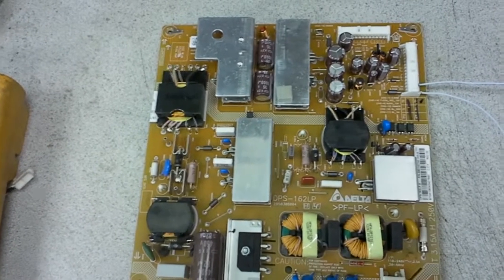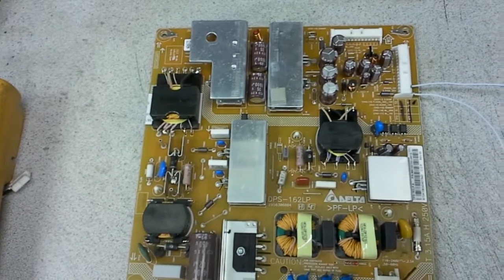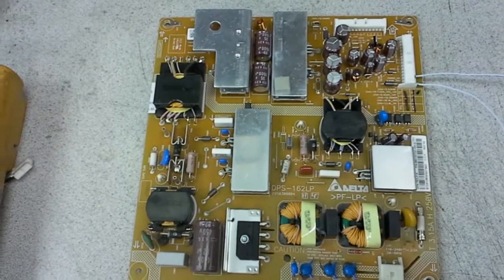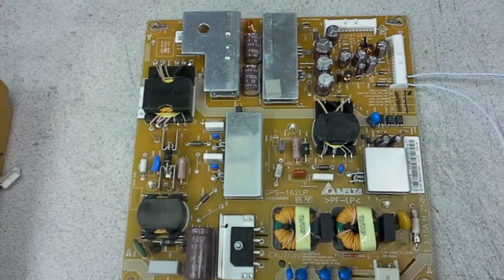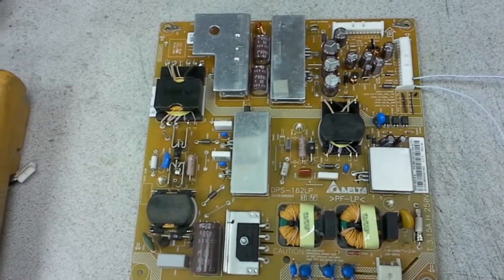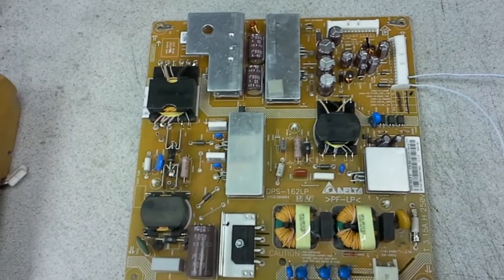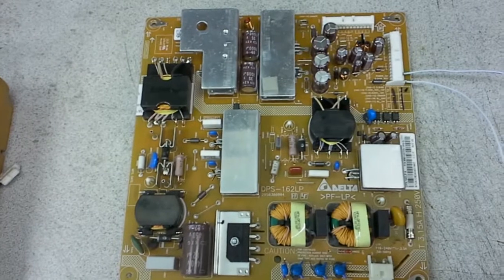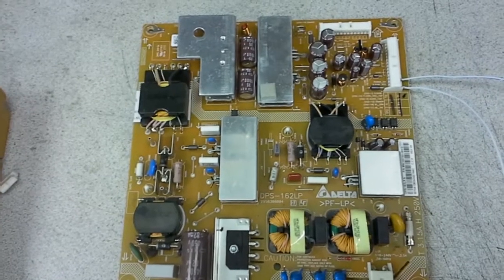If a problem persists after we send a board to a customer, it will be sent back and tested under load. We will either load it with an external electronic load, or most simply put a powerful resistor and start increasing the current until we see the breakdown value at which it stops producing output voltage. The standby voltage is very low power — 3.3 or 5 volts depending on the design, maybe up to 200 or 300 milliamps, in some cases up to an amp. The main 5 volts going to the power supply maybe 1, 2, 3 amps — again, depends on the design and model. We know what to expect, even if it's not printed, but of course it's better for it to be.